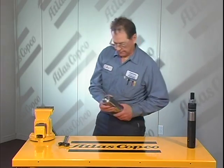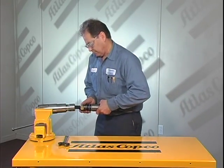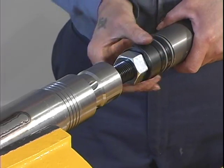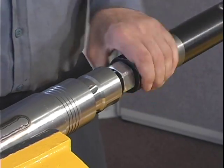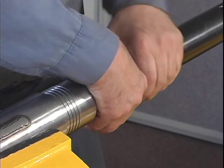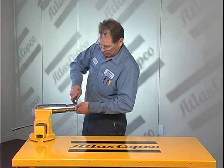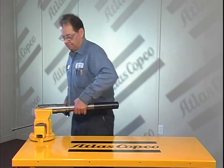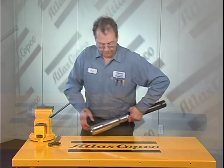Take the head and place it in a vise. Thread the bearing assembly to the box end of the head. Thread the lock nut so it butts against the head. Be sure to tighten the lock nut with an appropriate sized wrench until it's wrenched tight. This completes the NV head assembly.